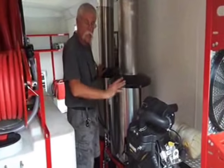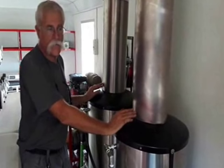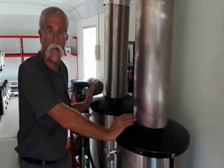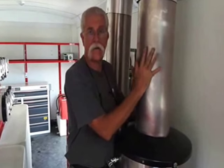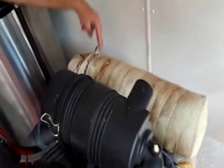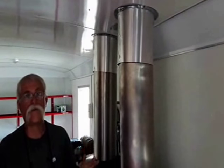He's got independent heaters for the independent pumps — both are 18-inch heaters. If he wants to reduce the flow down to 4 gallons a minute going through one of these monster heaters, he can have 230 to 235 degrees for doing tile and grout production-style inside the building. These are heat wrapped — double-layer stainless steel with an inch of ceramic fiber blanket in between, so it doesn't get any hotter than you'd want to lean against. The heat exhausts straight up through, the mufflers are completely wrapped, and the exhaust goes through a secondary silencer and then down through the floor. So the enclosure really is not going to get that hot.